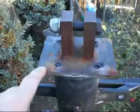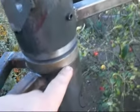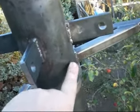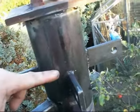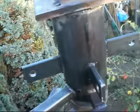So what I've done, I've reused the old plate and welded it all onto the bottom. My friend Marty has done it. He's coming round tomorrow to weld round this little bit here, to put a little joint round there so it's completely welded in the top. I've got 4 bolts here. As you can see, this turned around quite nicely now, holding the tube on, and inside there's a big steel bearing that goes up to there, with 3 bearings inside of that, and a shaft probably that thick in there. It's as big as a car axle.